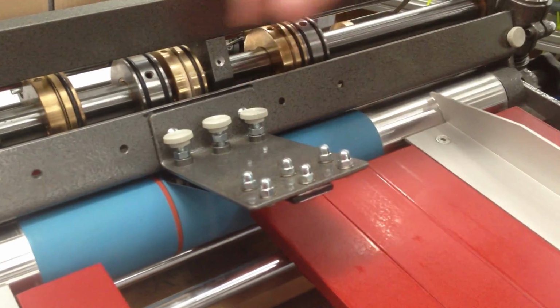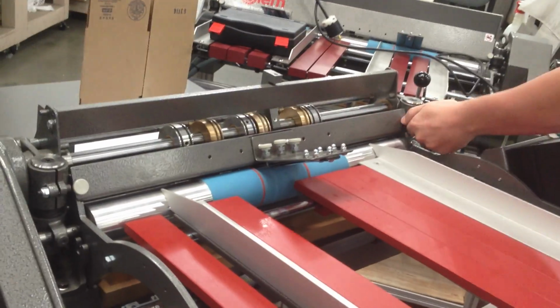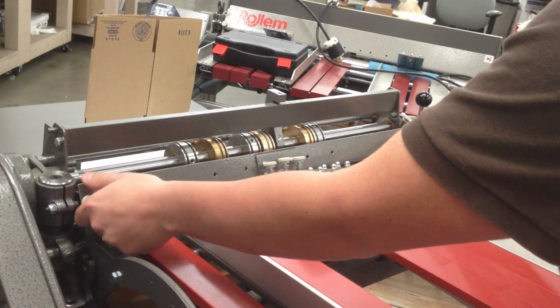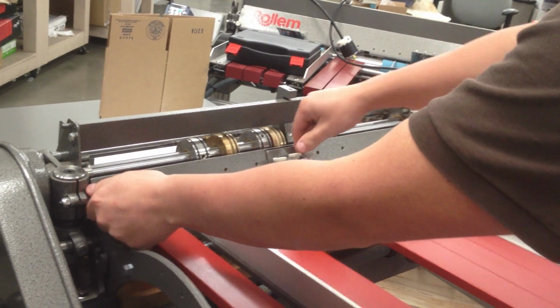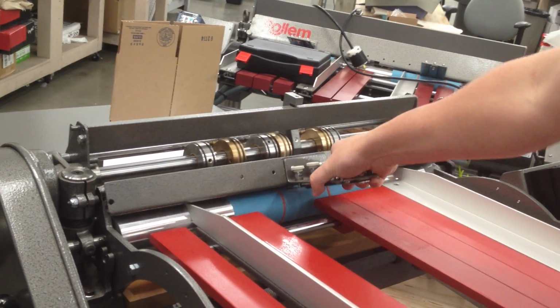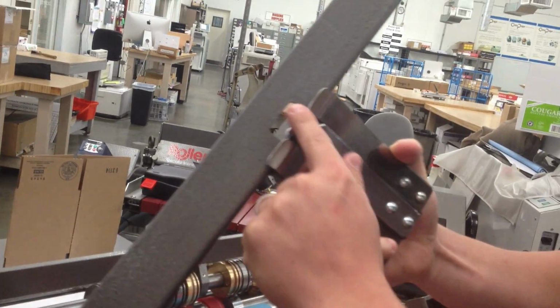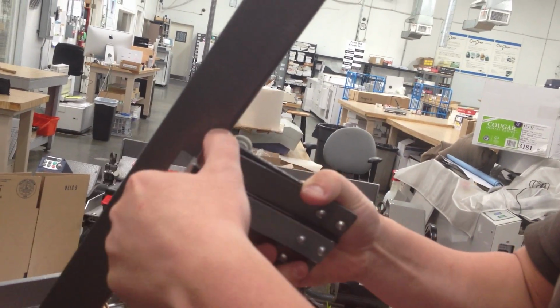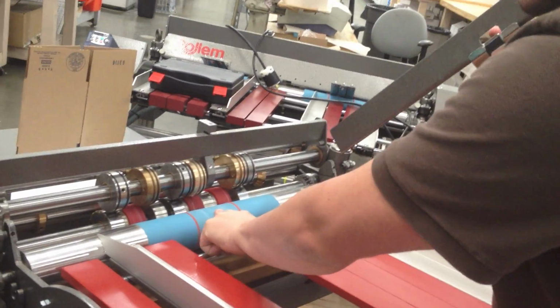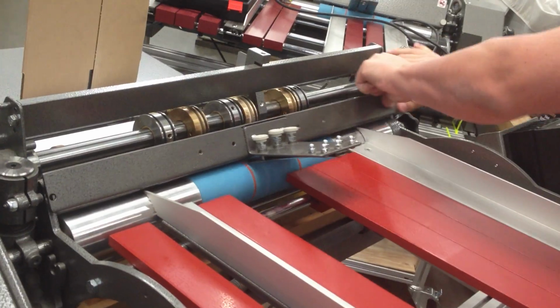The center tension is actually gonna, let me take it off and I'll show you. It's gonna be the tension of the paper. If it starts grabbing more than one sheet, just turn it from 12 to 1 o'clock until it stops grabbing more than one sheet. But what you have here is you have a rubber foot, and then you have some pressure. So this keeps the pressure. The rubber foot pushes the paper into this rubber adapter and pulls it through. It slides back in right here, and again, just the two.